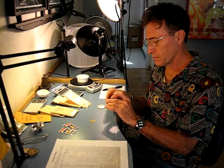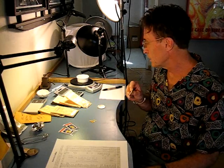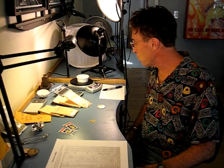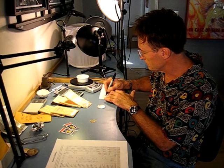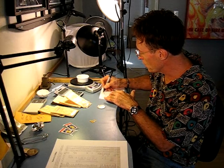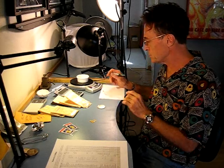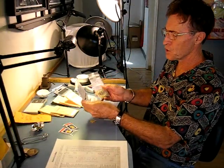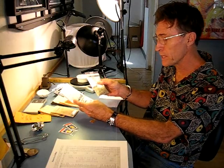Now to alloy fine silver — which is pure silver — and make it into sterling, we're first going to weigh this coin. It comes up to 31.2 grams. To alloy that, we're going to use a special alloy called F88. It's an alloy that has some non-tarnishing properties that I really like, from United Metals.